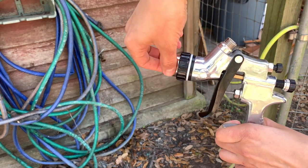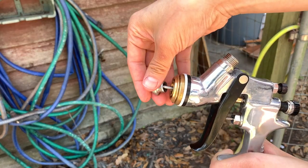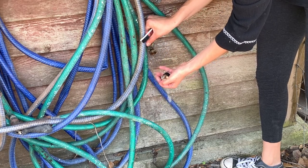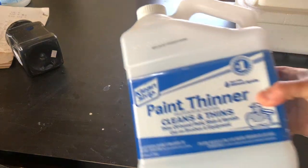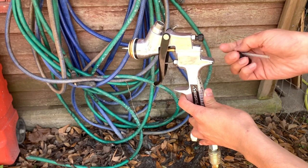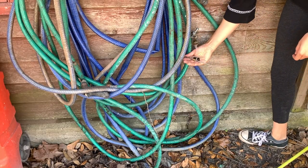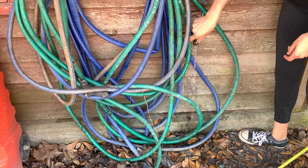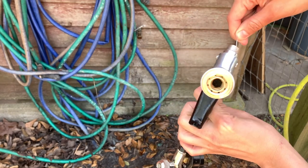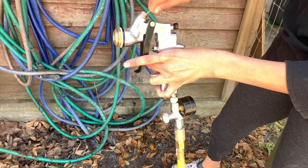At this point, it is time to completely disassemble my gun. Once disassembled, I take my nozzle and my air cap and run them under the water until they're clean. I then set them inside a container full of paint thinner to soak for about 30 minutes. I remove my fluid knob completely, allowing the spring and the needle to come out, and run them under the water as well. Then, just like the air cap and nozzle, I place them in the same paint-thinner-filled cup. I take my wire brush and run it through the gun with water removing any leftover paint, and immediately follow it with some mineral spirits or paint thinner. If needed, I will get a paint-thinner-saturated Q-tip and clean the inside as well.